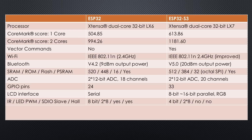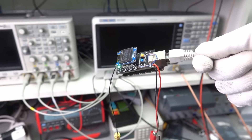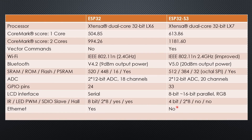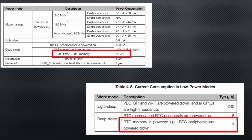In one of my last projects, I used the Ethernet functionality of the ESP32, which is handy. The S3 does not offer such an interface anymore — you have to use an external SPI controller. Comparing power consumption in a typical situation where they use Wi-Fi and do not transmit, both have very similar power consumption. In deep sleep, the S3 consumes 30% less.